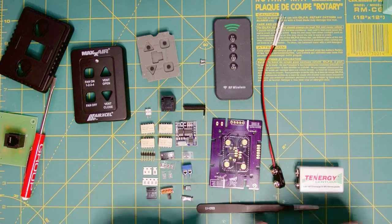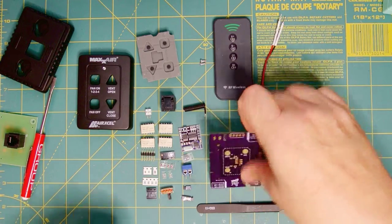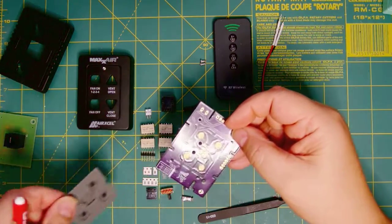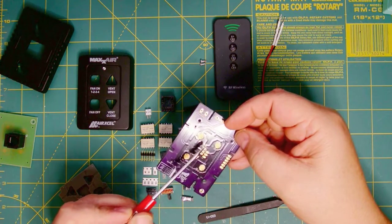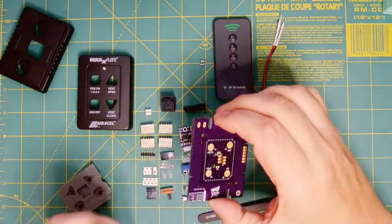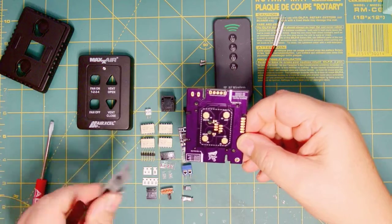What makes this project possible is this receiver — a 4-channel receiver, and you can see how small it is. Unfortunately I have to use surface mount technology, because with this membrane as it fits on here, I didn't want a bunch of components poking through. You can also see there's a cavity here that fits over the contacts for the modular connector. There are also two small resistors here and here that fit on this side board — the same thing on the old board here and here. These are smaller than I like to work with, because they've got to be small enough for this membrane to fit over.